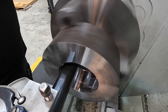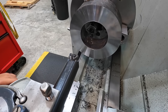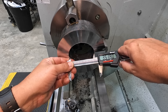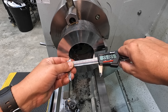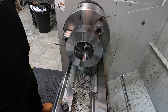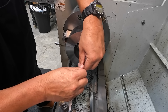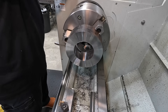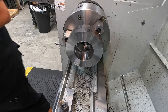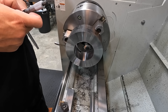Setting a Z zero there. Won't take much more to clean that up. We want to take it to about 553 thousandths to give it ten-thousandths clearance. We're right around 520 right now. I'll use a telescoping gauge and micrometer — I just use calipers as a quick reference since they can get you within about five thousandths. Made another light pass and we're closer now. Making a finish cut using our Starrett telescoping gauge and three-to-four micrometer. Measuring — we're at 3.539, so one more pass to go.